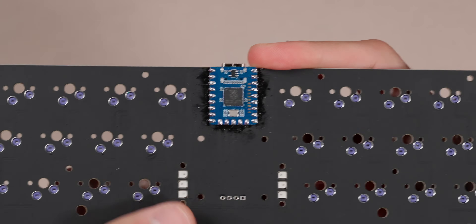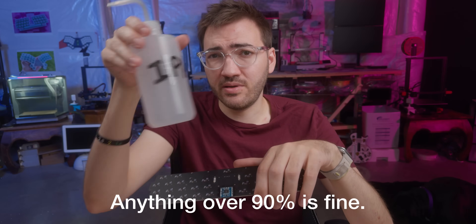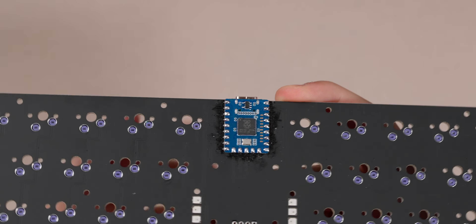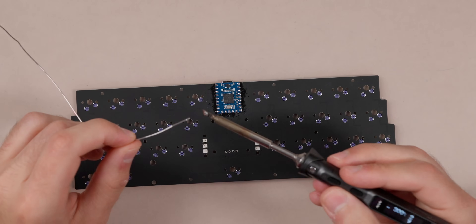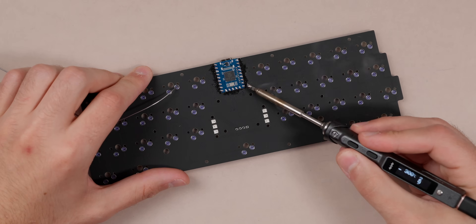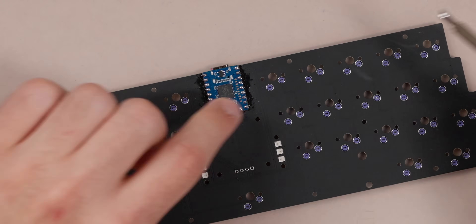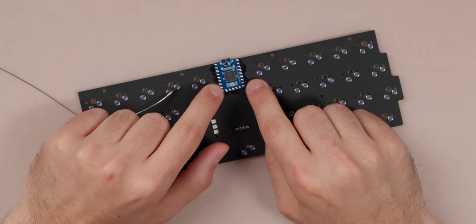There's the controller mounted on there. As you can see everything is soldered nicely, though we do have a lot of flux which I'm going to clean off in a moment using 99% IPA. What I recommend is actually reflowing these pads a little bit after doing them — you come in there, re-wet it and pull off. The reason is that it helps the pad connect better because you can't really see underneath it, so doing that really ensures a good connection.